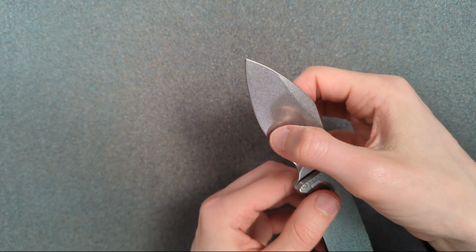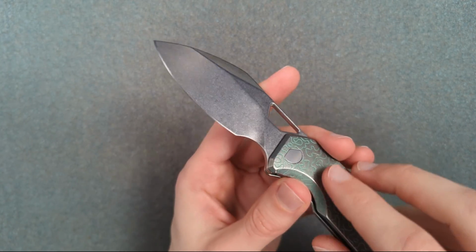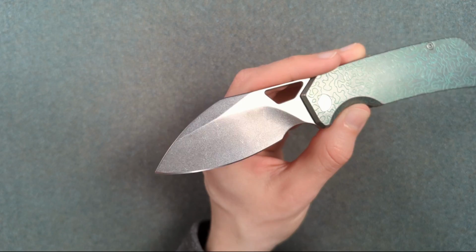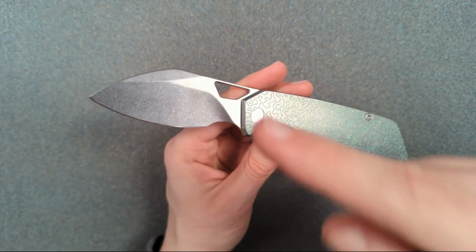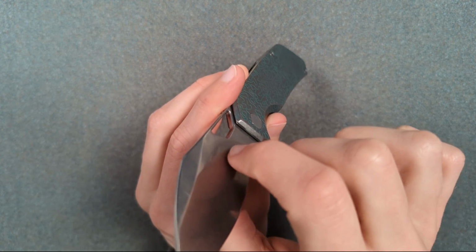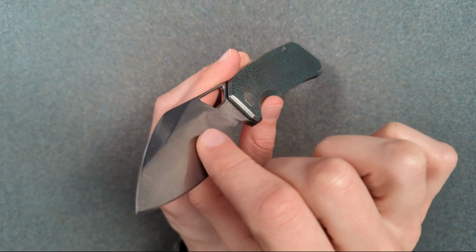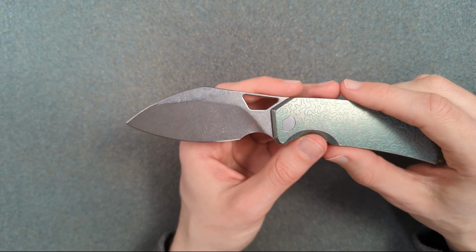But this is an insanely tall hollow grind. He grinds this at an angle on the machine, which makes it so that he can come in with a steeper, taller, and deeper hollow grind than you would be able to do with a traditional hollow grind, which is done on a barrel grinder of some kind. And so this is an even more exaggerated, amazing hollow grind. This is going to be even taller and thinner for longer than on one of those Burgers that I rave about.